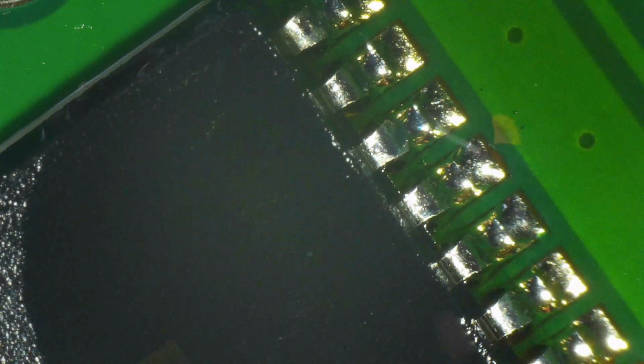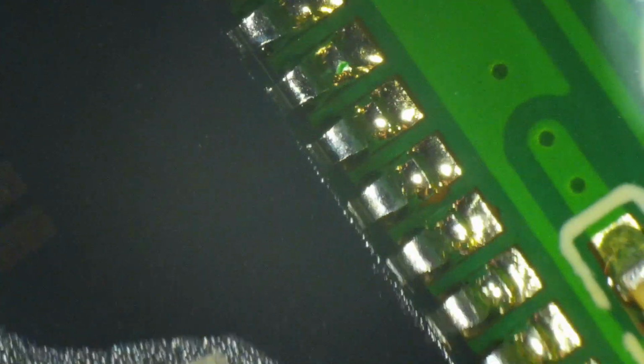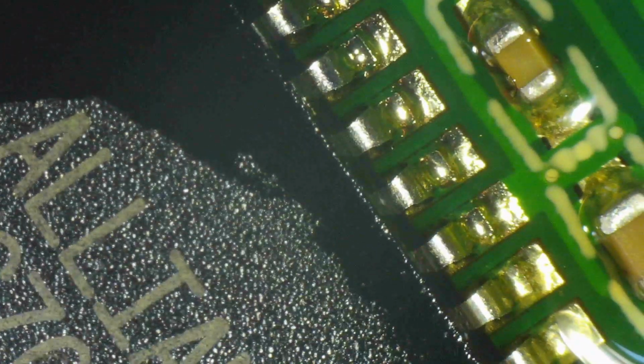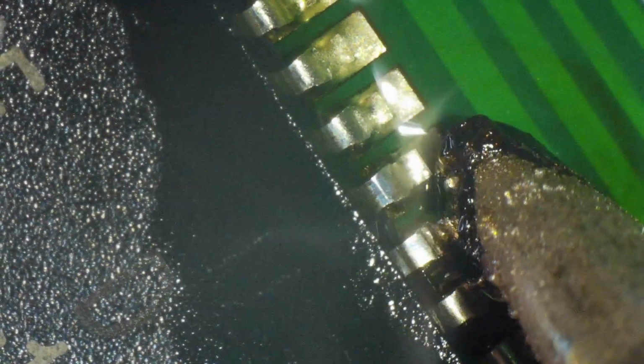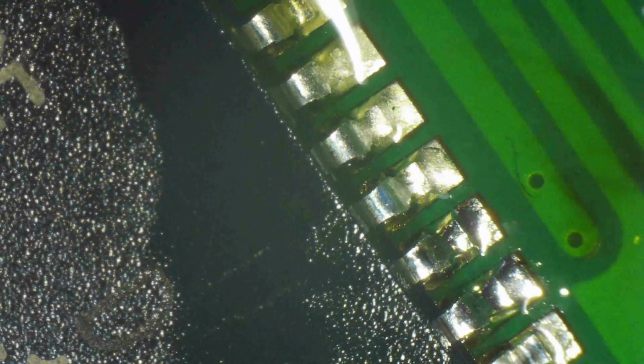Again, you don't press the soldering iron down too hard, but you also don't go too feather-light on it, because otherwise you don't make contact and you don't transfer heat. Now I'm inspecting it through the melted flux, because it helps reduce the glare and the diffractions. Then I find a pin that seems to have too little solder, so I go back with a pre-tinned tip and reflow that one, so now it has more solder, now it looks good.